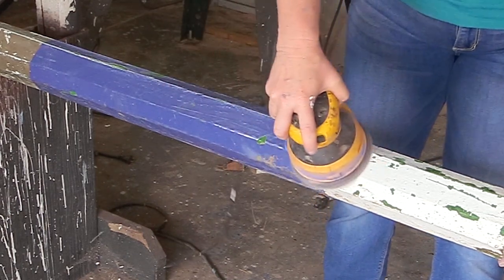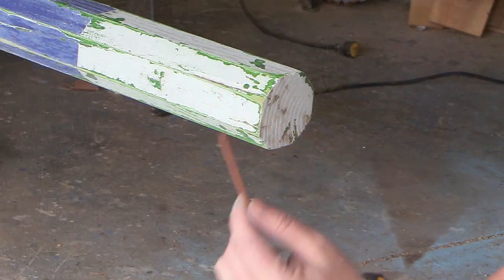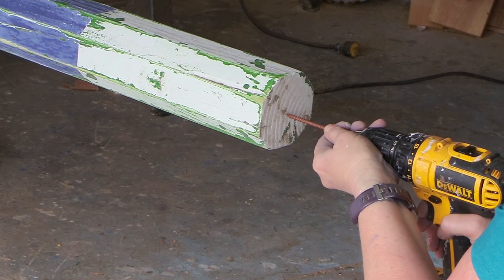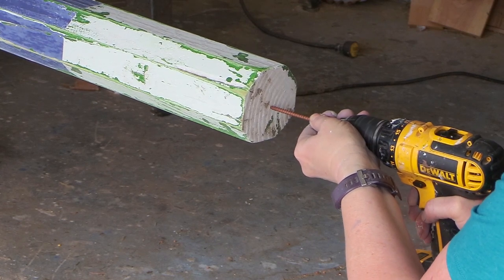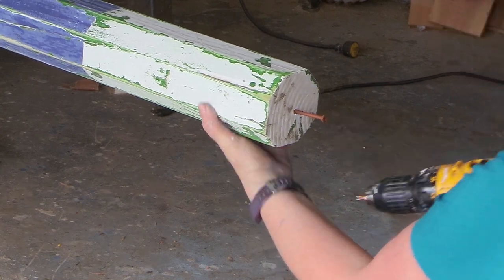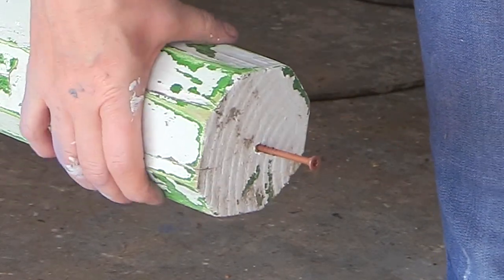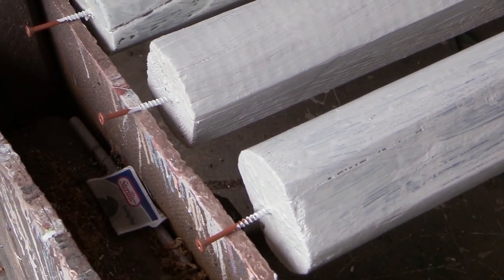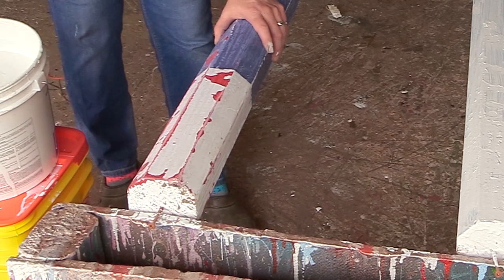Something new I've been doing is attaching a screw to the ends of the rails themselves. By doing this it makes it a lot easier for me to paint the rails all in one sitting, so I don't have to paint one side and then wait for it to dry to paint the other. You just take a screw — these are three and a half inch long decking screws — put it into the end of the rail, leave the end exposed. This is what it looks like when set up on my painting station, so I can paint the rails really easily and they move and spin.